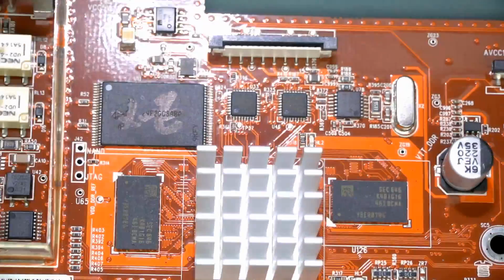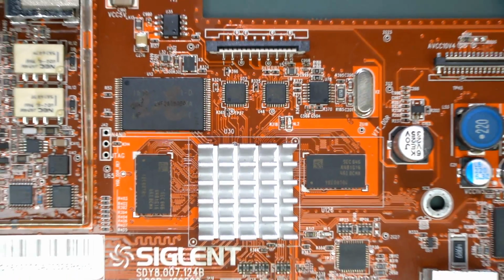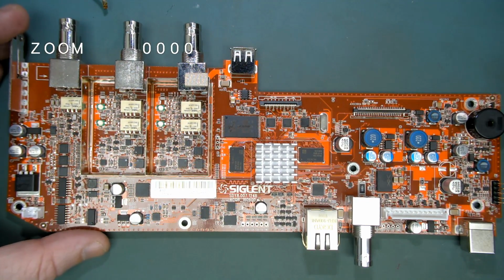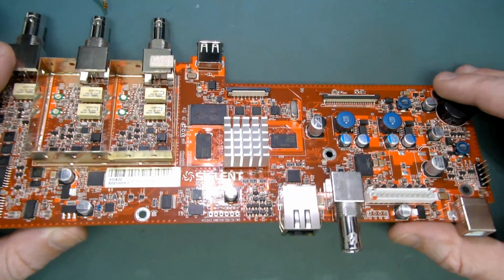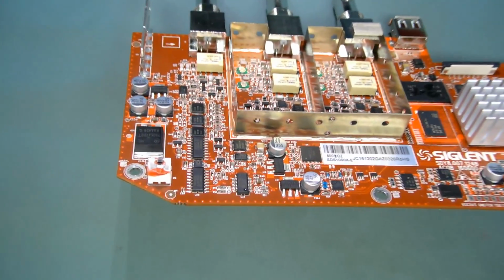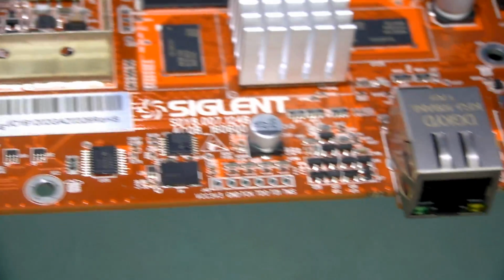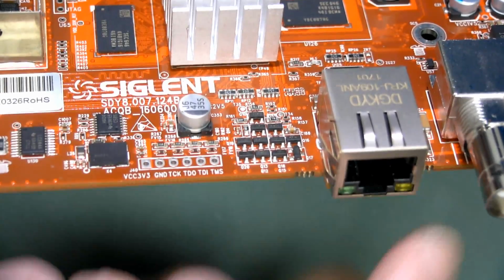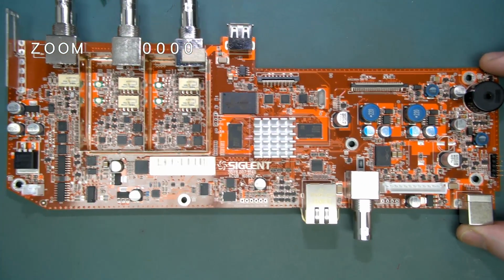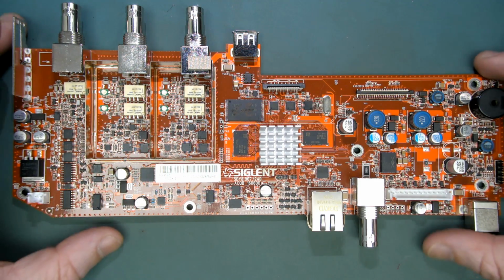But hey, for this ultra low-end one, it's different. So I'm very surprised to see it integrated into the main PCB. But the PCB itself is relatively small, so maybe that's why they can get away with it, and they can fit multiple ones in the one panel, of course. Yep, you can see the mouse bites there and there on the board, which shows it's all panelized, so they've size optimized this probably to fit 4 of these on one PCB panel or something like that. So that's how they can get the cost down.